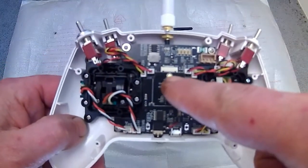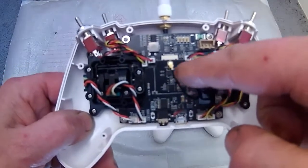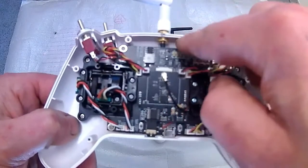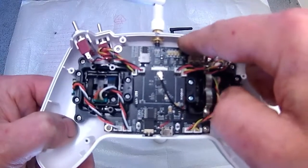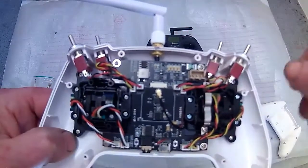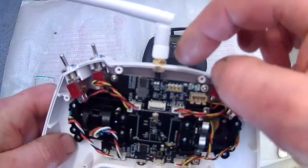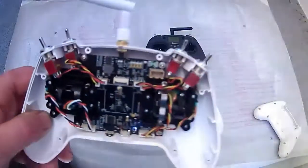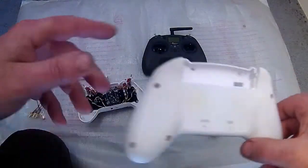You've got a UFL connector that goes on there, and the way I mounted it — because the wires were a bit long — I mounted it in between the boards and coming out the top. When you get it stripped down, there'll be a panel like a sticker with the wire going into it — that'll peel off. Just peel it off and throw it away, because once you bend it you can't reuse it. You want a 7mm drill and drill the top part of the section — don't do the bottom part, because that's the battery compartment.